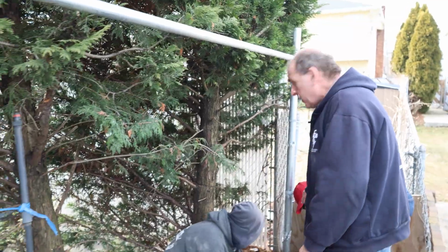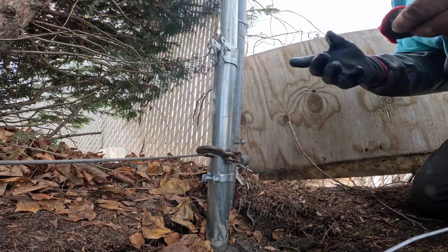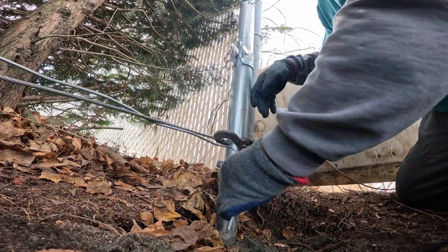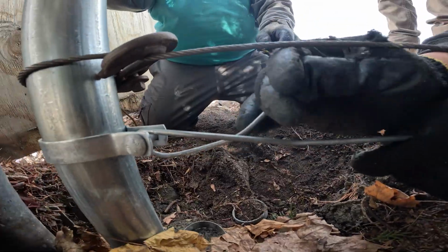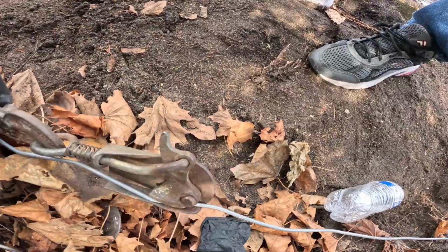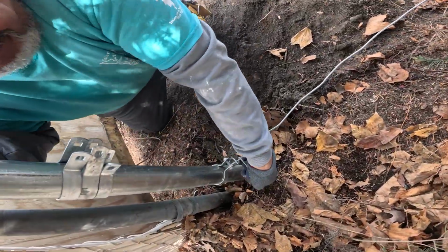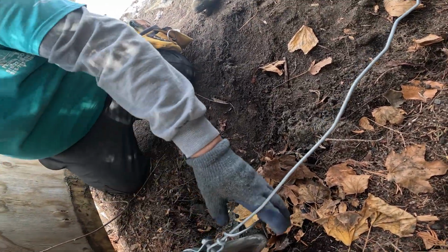Now, once it's tight, they're going to cut it on the end, feed it through the other brace band and tie it. Fred's going to put gloves on so he doesn't leave fingerprints. Okay, now we're going to bend this. Now we're going to get rid of the come along so we can bend that around easy. Now the dog comes right off, and now Freddie's going to finish that. Okay, now we're going to cut it.